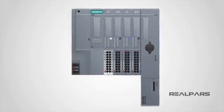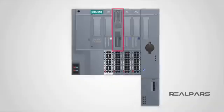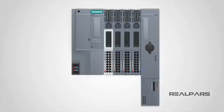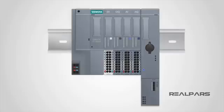Now let me show you what happens if I take one of these I/O cards out. Take a look at this other part — we call this a base unit. The base unit is, as the name indicates, a base where you can install the I/O cards. In order to install the I/O cards on the ET200SP, you must first have a base unit installed on the DIN rail. Once in place, you can install your I/O card.